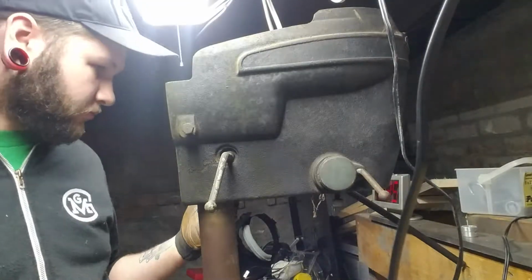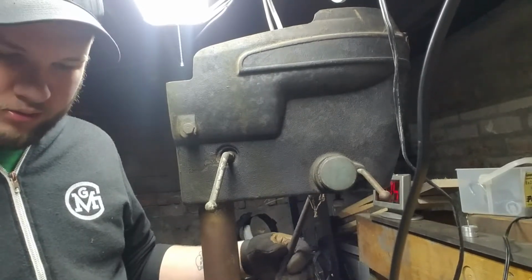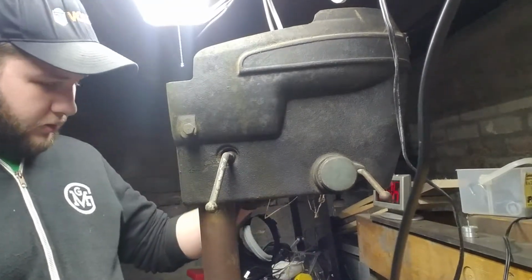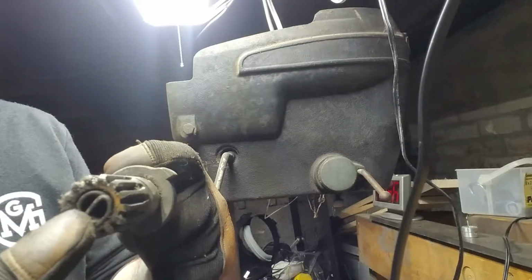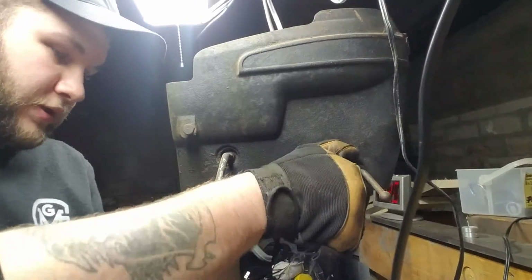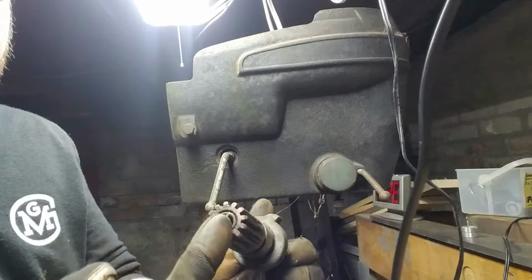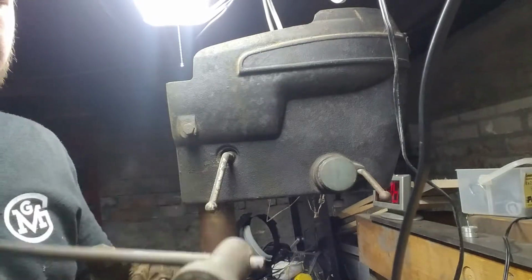So that guy comes out. Couldn't really see it on the opposite side here, but take some of the tension off the spring. The handle you actually use to drive this up and down. You just slide it out a little bit, and that's what releases this. And now that that's totally released, just slide the whole handle off. See, there's a spring there. It's got the bar through the middle of it. What that's for, this guy right here. On the inside of there, it's a shaft with a slot cut through it. That spring goes into that shaft, or the shaft goes into the spring slot. It's for that bar there. And that's what, when you crank it down, allows it to spring back to where it was.